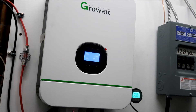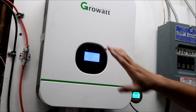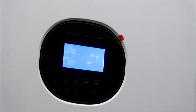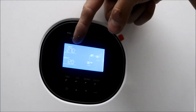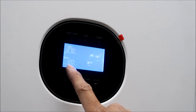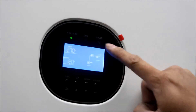I just want to go over how this thing is set up initially - it is brand new. I've never fired it up yet and this is what it looks like when it first starts up. Wow, the voltage is already starting to go down. These are all the settings when you start it up initially. It says your battery voltage - that's about right, 27 volts - and then this is the inverter output right here if it's outputting anything.